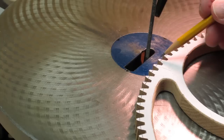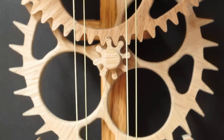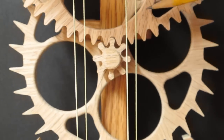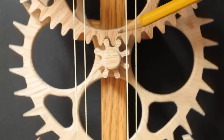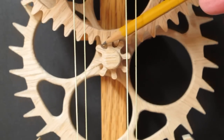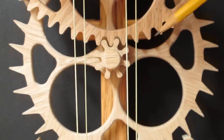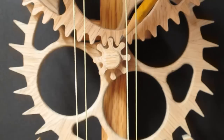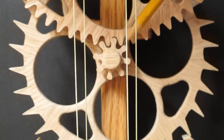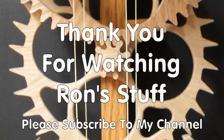What that does is eliminate any possible interference with the pinion gear. The design of the clock allows for wood movement due to temperature and humidity changes. By rounding over the corner of that tooth we're keeping it from digging in with the pinion on entry, and on exit keeping it from dragging on the pinion tooth, which just helps ensure that the clock will run smoothly.